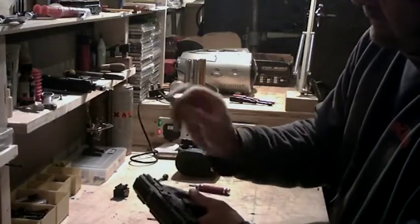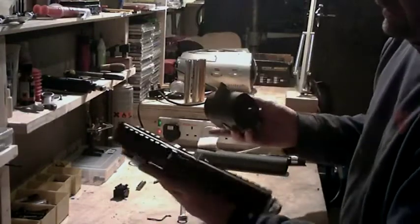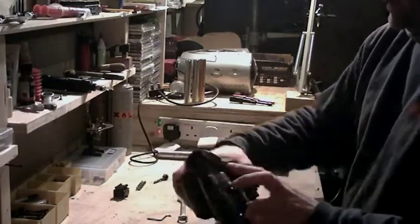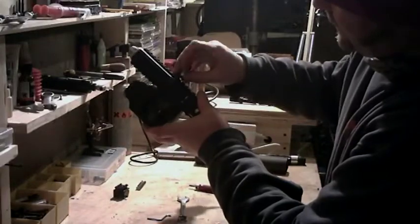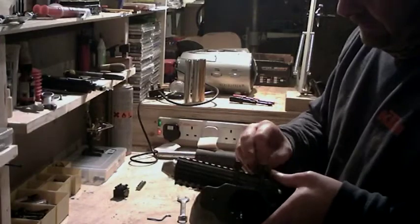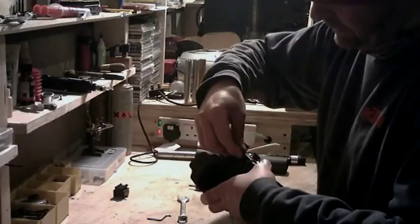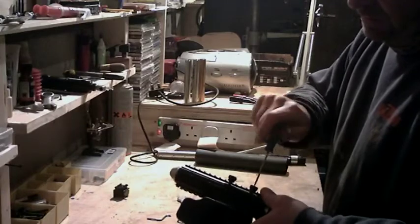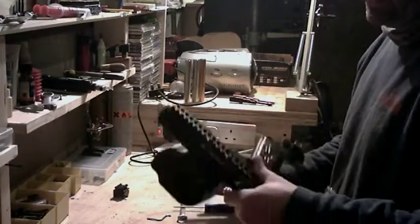Putting on the rip clip. This is the ball guide — that just drops into there like so. There's your rip clip; just push your rip clip over the ball guide like so. Vaguely hold that in place, drop these two little bolts in, just start them on the thread — that's all you need to do. Then there's a little clamp part that drops onto there; once that's in place just pinch them up. And that's your rip clip mounted.